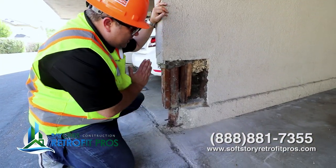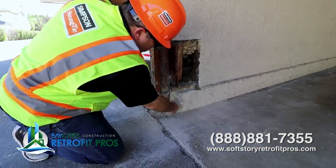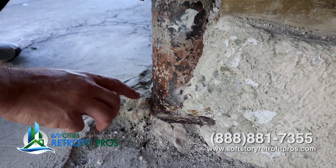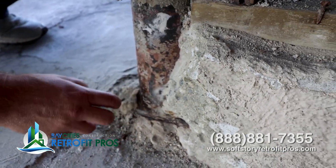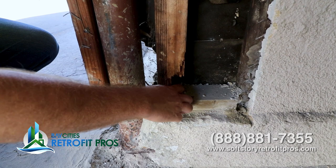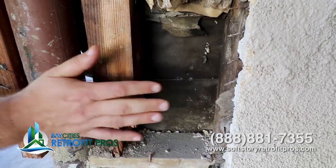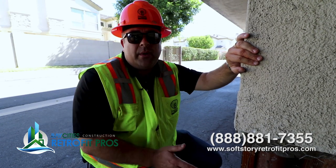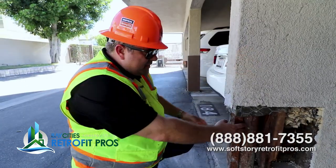Let's talk about what's going on here. This is a structural member — it's an orthogonal wall. This is the rebar we exposed a little bit because it was cracked, so we just opened it up to see. There's a little bit of rust in the column. How bad that is we don't know, but see this crack right here? An earthquake will break anything that's weak, and pipe columns will bend at the base where they go in the ground. This mud sill has a bolt there — that's good. The problem is they notched out this big wall stud and there's absolutely no plywood shear on either side of this wall. Although it carries a gravity load, it's not a very good lateral resisting wall.